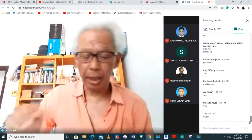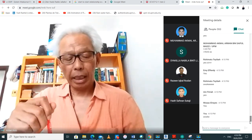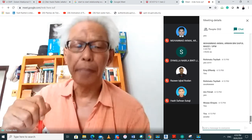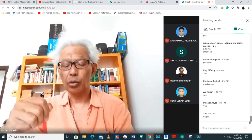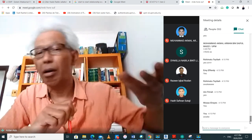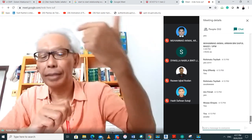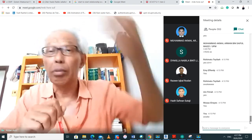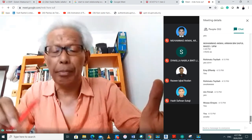So, with that purpose, the F sub S, all right, I'm now looking at this load distribution for friction piles. So F sub S is not necessarily constant for the above case. You need to integrate over the embedded depth. Okay, that I already explained to you. Because they are not constant, the surface area is increasing with depth. And then, in cohesionless soil, it is a curve. So you need to actually integrate over the whole area with respect to that. But for the Q sub U, it is easy.